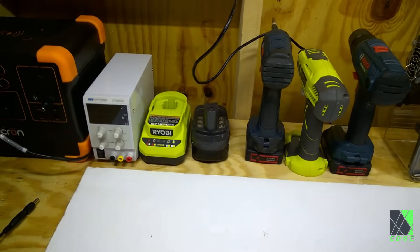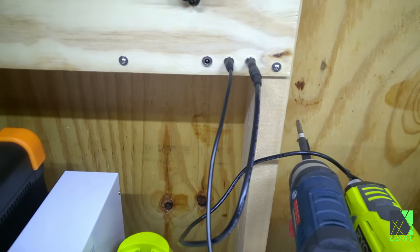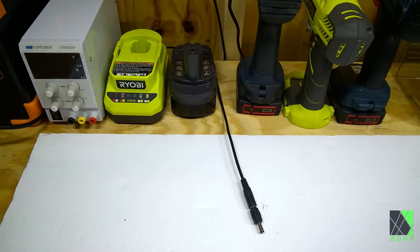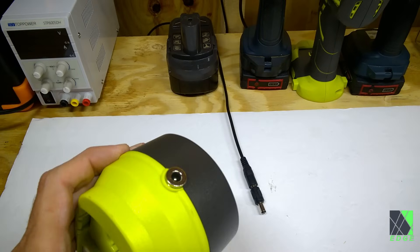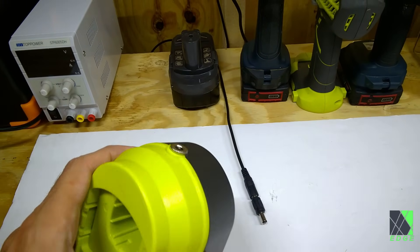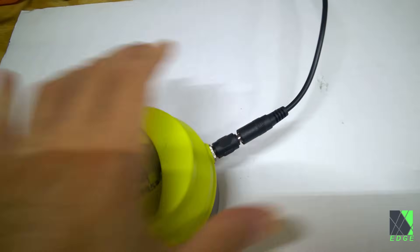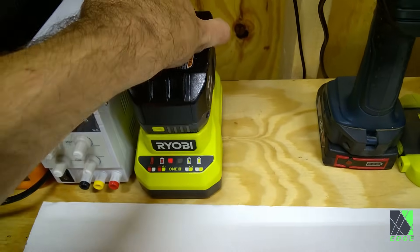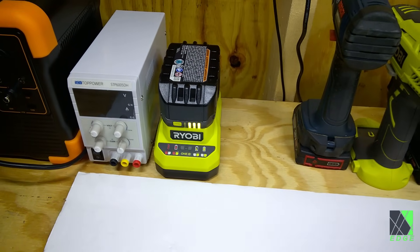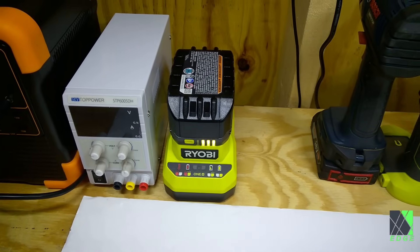First I'm going to plug into the wall using a 2.1 millimeter cord — there's an open circuit. All these circuits are fused and directly attached to solar panels, so if I make a mistake, hopefully one of those fuses will blow. The first thing I'm going to demonstrate is this Ryobi battery charger. All I have to do is plug it in — this charger is self-contained and able to run off of any solar power or DC input, and it's current limited so it's safe. It just plugs right in the back. So there it is: no charge controller, no inverter, no battery, no AC to DC power brick — just solar-powered Ryobi battery charging.